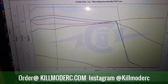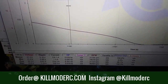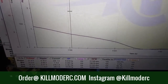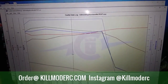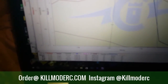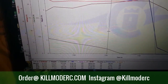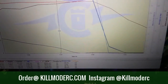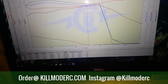About a third of the way into this run, I'm drawing 335 amps from this ESC. My voltage ripple is at 0.78 — really good — 31,000 RPM, 100% throttle. Getting a little further in, maybe halfway into this run, my voltage ripple is all the way down to 0.37 volts, still drawing 311 amps, almost 35,000 RPM, 100% power out. And this is where it gets interesting again.